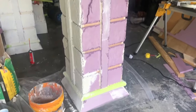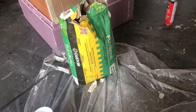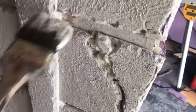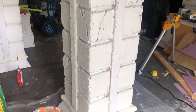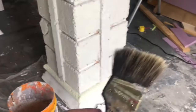I started applying a hard coat to the column using Flex Bond — you can get it in white or gray, and I got the white. You basically pour some into a bucket, add enough water so that you're able to spread it onto the column, and mix it up. Then just use a paint brush and apply it. I also like to blot and poke at it once it's spread on so that it gets a nice rocky texture. Mix up only a little bit at a time — basically just one side per batch — and wash out your brush, because Flex Bond dries quickly and it's easier to work with in smaller batches.